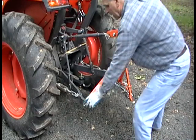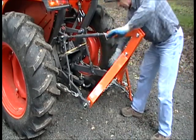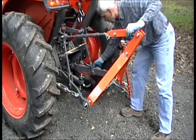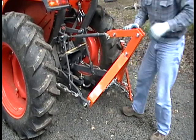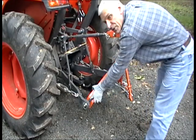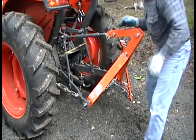Now we want to verify that the swing arms are at the extreme travel against the locking pin. I will just snug up my lateral swing a little bit to minimize the swing. We don't want it tight, but that allows for about a half inch space between the lift pin shoulder and the lift arm spherical bearing on both sides.